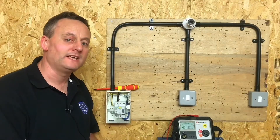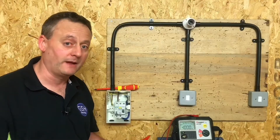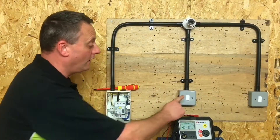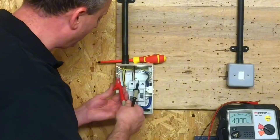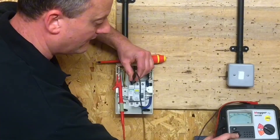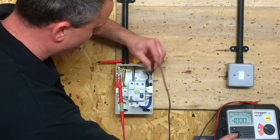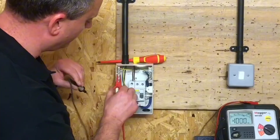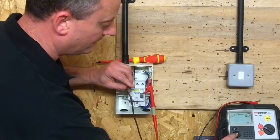For the AM2 and AM2S assessments, they'd like you to do your insulation resistance test this way when there's two-way or two-way and intermediate switching. I've done the test once but can't remember whether I left the switch on or off, so I go to the switch, operate it, and repeat all three tests again — back to the earth bar, top of the breaker, press and test; across the neutral bar, press and test.